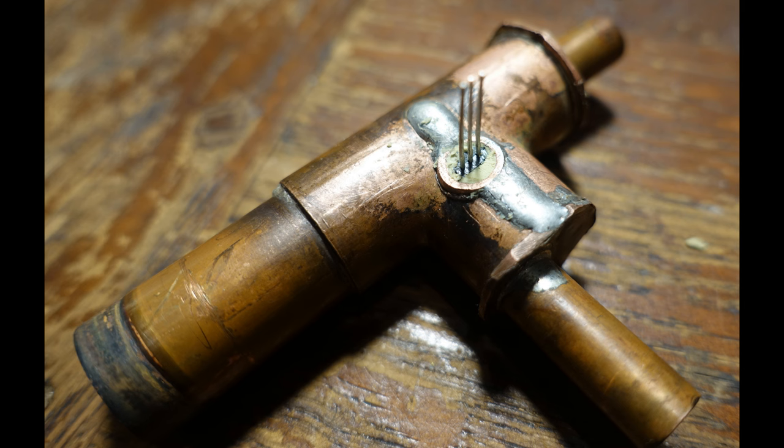The resolution is to a 16th of a degree, but the temperature they give is only accurate to within about 1 degree. However, in this application, they are calibrated to a temperature close to the temperature of interest. And once calibrated, I found no appreciable drift over several months.